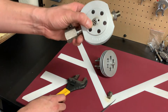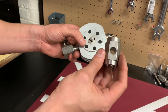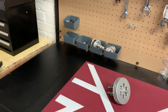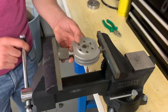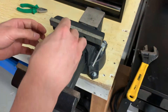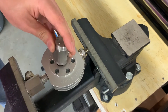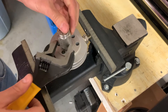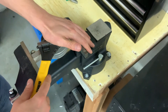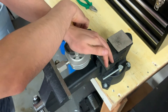Now we're going to move to the suction valve. To do this we need a valve key — this valve key is specific for Alken valves, so you need to get one from Alken Compressors. They're not expensive but very good to have. I place the pins right on the holes in the intake, use a wrench, push the valve down so it won't move, and start turning it to screw it out.